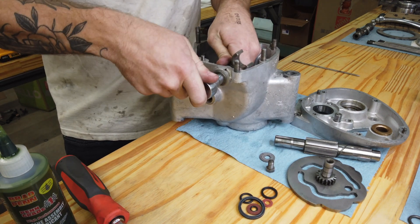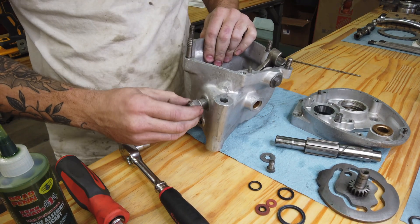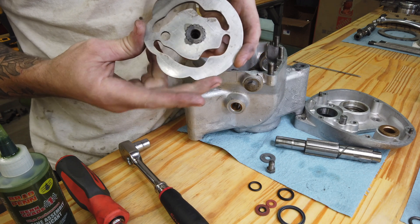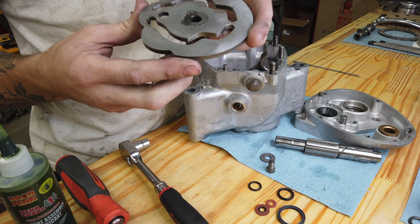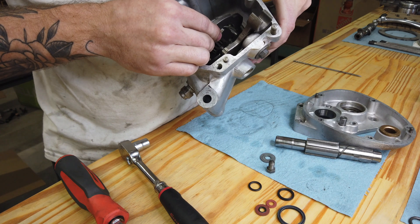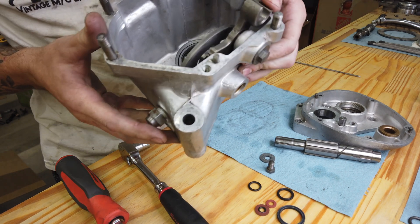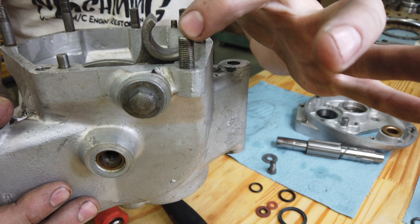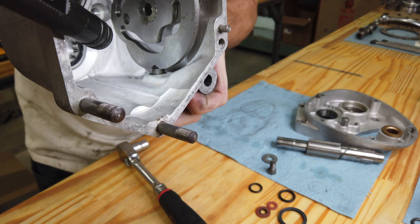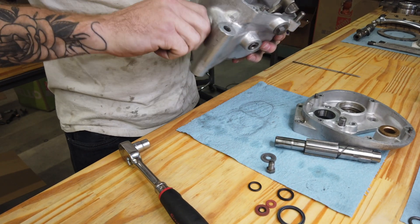You've got your quadrant in. Now I'm going to install the plunger — not all the way in, but enough to help keep the cam plate in position. This is going to be the detent you're going to use to time this. Lubricate it a little, then start it once you've got it butted up against your detent. Align it so this stud and the top inside of the radius are aligned — that's the location of the plunger into the detent on the cam plate. Now that's timed up, I can go ahead and snug up the plunger.